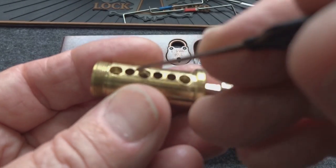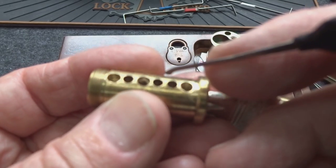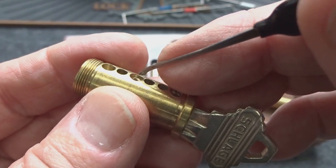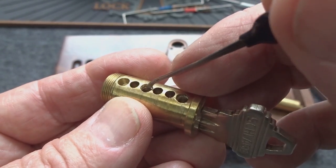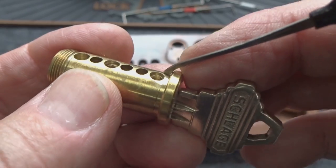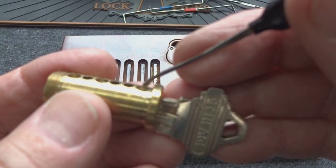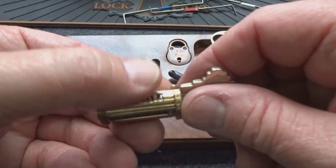I'm starting to not feel so bad. We have counter-milling inside of here for sure — a nice sharp ledge, very nicely done on number three. We also have counter-milling on number one; it looks to be mostly on that side and on the front, but when you look at the back side there's nothing there. Maybe when they did the counter-milling the bit was off alignment, but it definitely had an effect. On number one it looks like counter-milling and threading — maybe just counter-milling for the first sixteenth of an inch or so. Let's pull these sliders out.